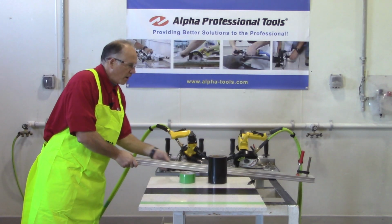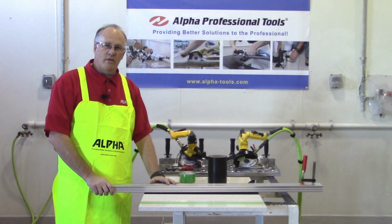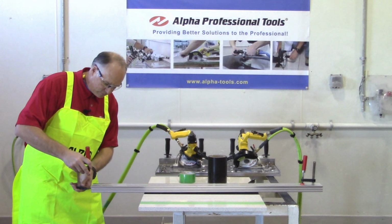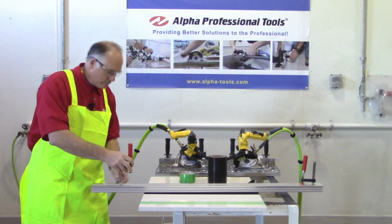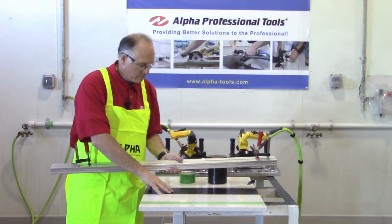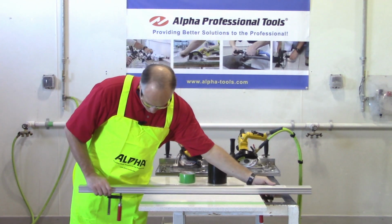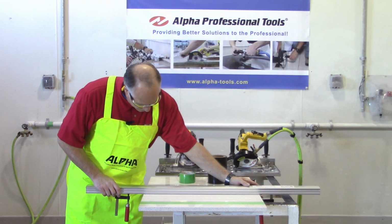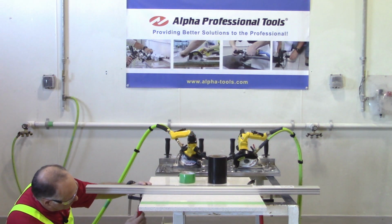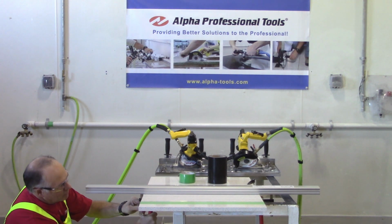Now we have our guide rail. The way the guide rail mounts and secures itself to the material, we have clamps. The clamps slide into the channel on both ends. So now I'm going to take the guide rail, and I already attached the surface protection tape. So I'm going to line that up with the tape. And then the guide rail, I just take the clamp and tighten the clamp to secure it on both ends.